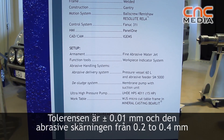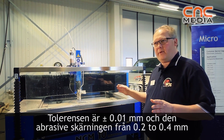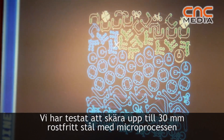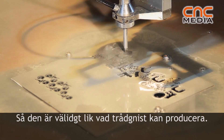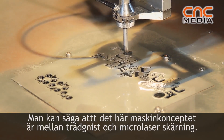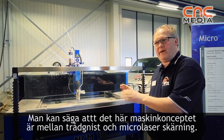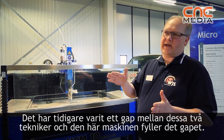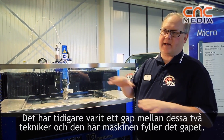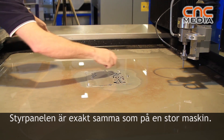The abrasive cutting jet diameter is from 0.2 up to 0.4 of a millimeter. We have tried cutting up to 30 millimeters of stainless steel with fine abrasives, so it is very similar to what wire EDM can produce. This machine concept sits between wire EDM and fine laser cutting, filling a gap that has existed between those two segments of machine types.